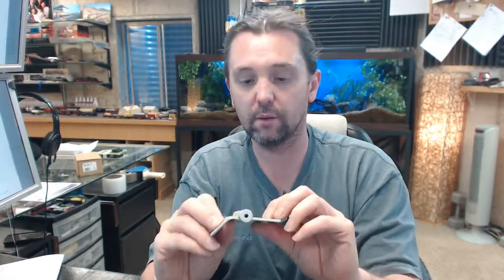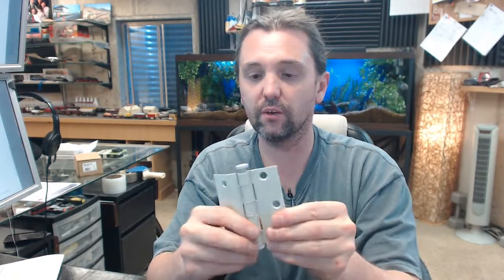This can be mixed and matched with a 3.5 inch commercial grade hinge, meaning if you have a door that has failed, you can install this at the point of failure and leave your other hinges in place, because that vertical axis of pivoting is compatible with a 3.5 inch by 3.5 inch commercial grade hinge. Okay, a lot to consider with this hinge for sure.